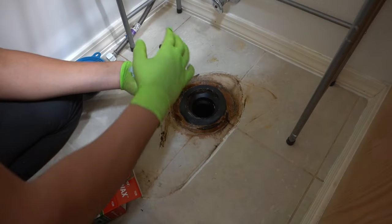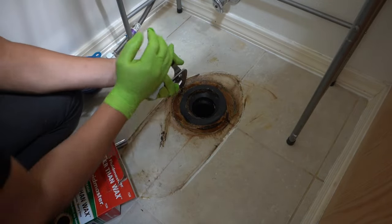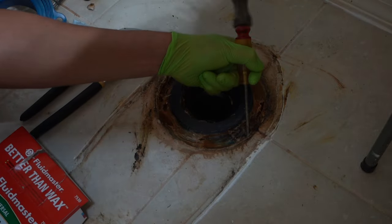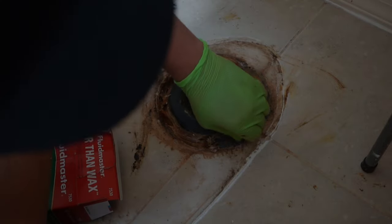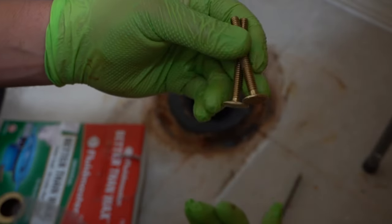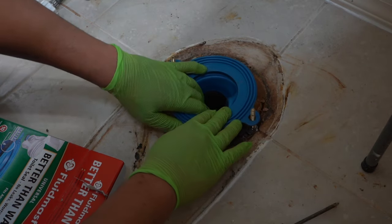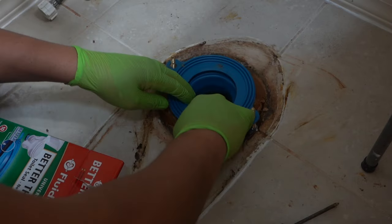It's a little hard to take out those tank bolts attached to the floor, so I'm just cutting them off. In my situation, somebody had grouted over where the nuts were located, so I had to chisel away to loosen up the remaining bolts and nuts underneath. Take your time — it should come off on both sides. The Better Than Wax kit comes with replacement hardware. Place the new bolts exactly where you removed the old ones, tighten them up, and then place the Better Than Wax seal over the toilet flange, fitting it nicely around it.